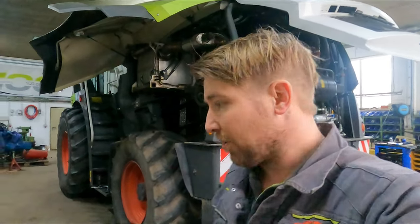We've got the oil running out of the differential on the rear axle. We've checked the rear axle from the inside for any defects or wear or problems. And now we're gonna empty the rear final drives. To do that, we're gonna lift the back axle up, and we're gonna lift it up each side so we can turn each wheel individually.